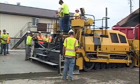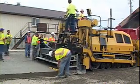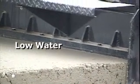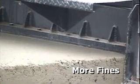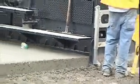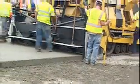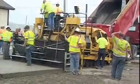The Gameco Roller Compacted Concrete Screed is specifically designed for this application. Roller Compacted Concrete, or RCC, is a different kind of concrete. It is not air entrained, it has lower water content, and RCC has a higher fine aggregate content. Roller Compacted Concrete saves time, lowers cost, and provides quality over hot mix asphalt. This zero slump, high density mix design allows you to walk immediately behind the paver on the freshly poured slab.